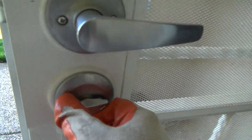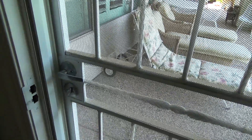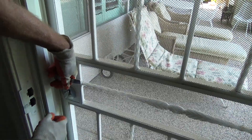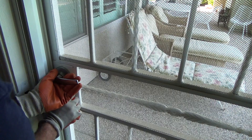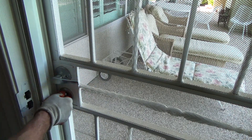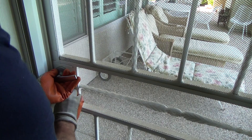I know it's sagged a little bit, and how do I know? It's because when the door closes and I throw the deadbolt, the bottom edge of the deadbolt hits. You've got two places — the door latch fits into that one, and the deadbolt is there. See, it's not locking. It can lock if I lift up on the doorknob just a little bit — it's not going in all the way, but if I lift up on the doorknob it goes straight in, but then it's hard to come back because it's hitting the very bottom, it's rubbing.